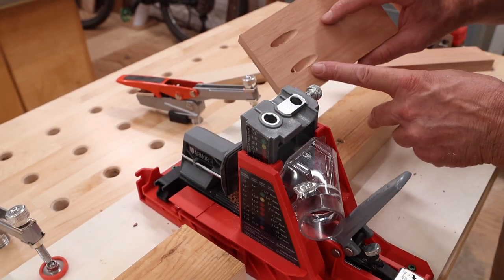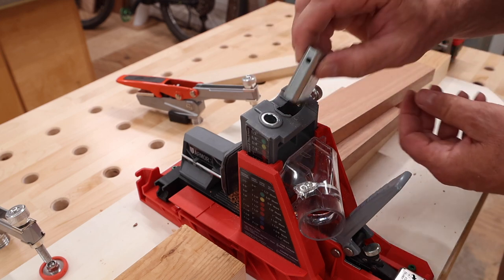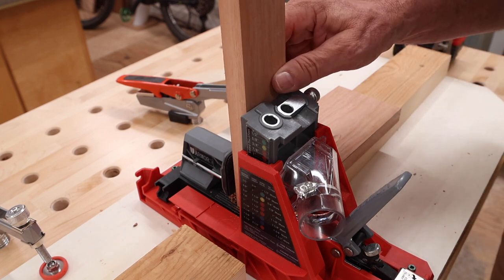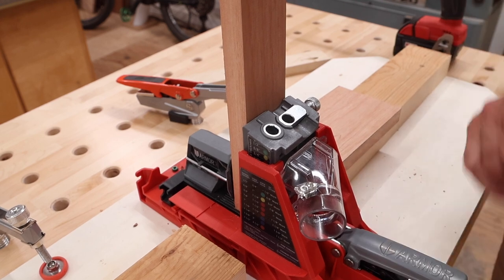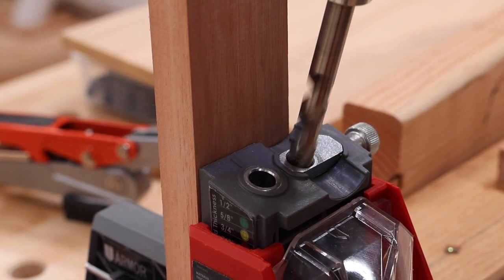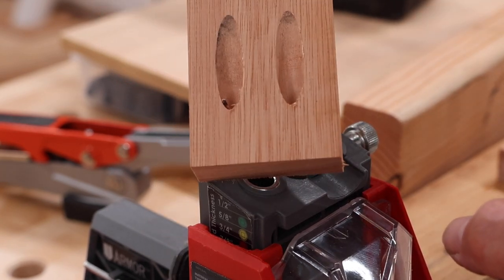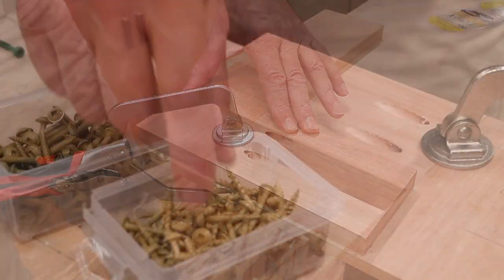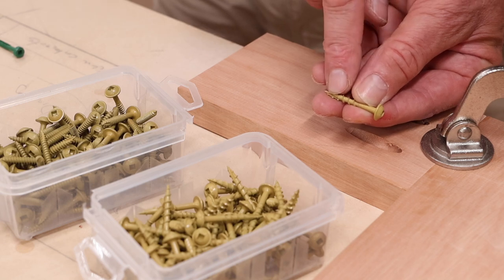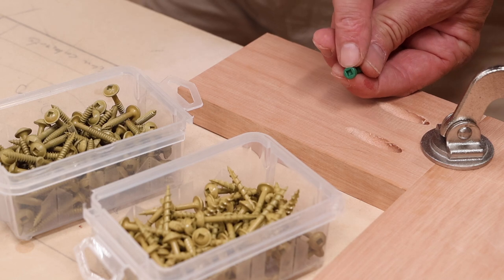That was a 3-quarter by 3-1/2 inch board, but let's say we want to use two pocket holes in a more narrow board — this is two inches wide. We can remove this piece, drop it back in, and you can see the holes are closer together. Tighten that up, put the board back in the jig, center it, clamp it down, and drill the pocket holes. The Armour Tool screws are just like any pocket hole screws — they have a washer at the head. The coarse threaded screw is meant for softwoods and the fine threaded screw is meant for hardwoods. The one-inch screw has a different head, but that's only for the one-inch screw.